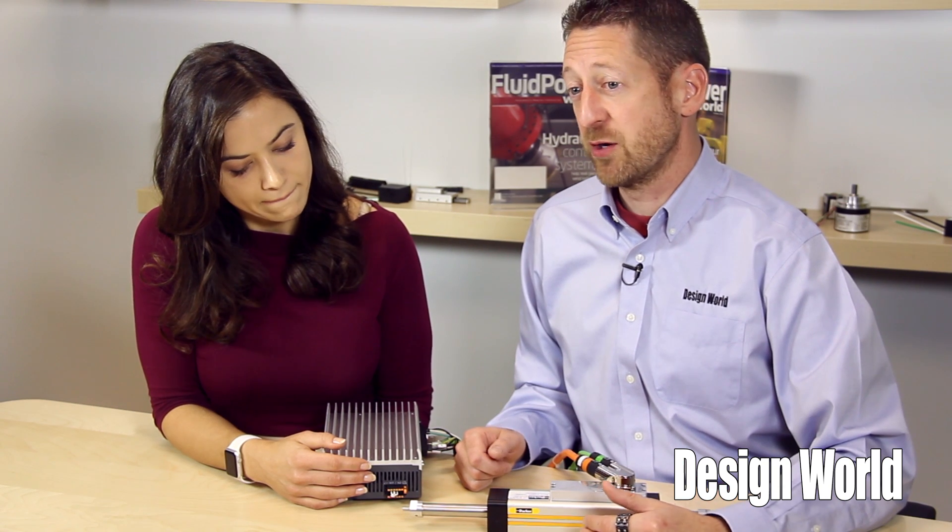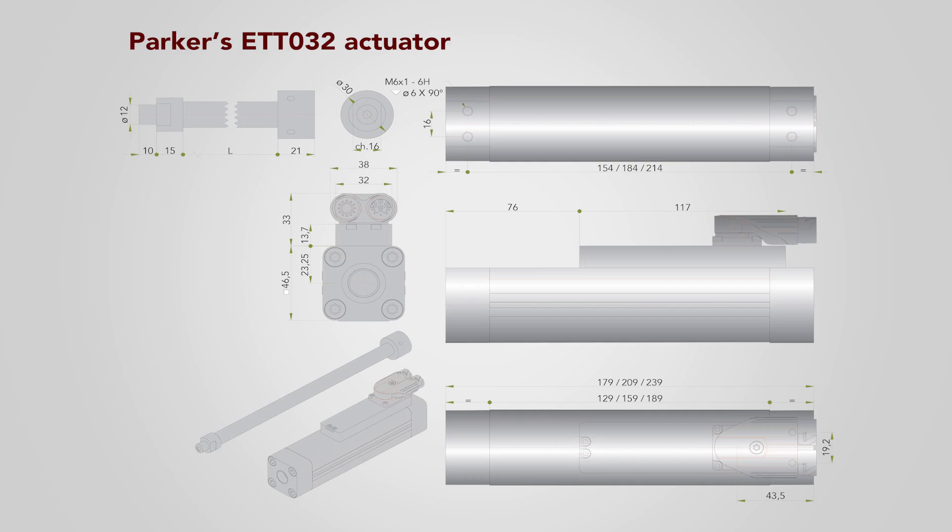The tubular motor has two main components: the rod shaft and stator with integrated feedback. The shaft is a stainless steel tube containing neodymium magnets that, thanks to their high performance, deliver impressive thrust values, even up to several hundred newtons.